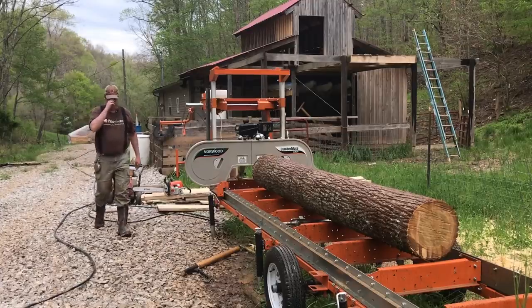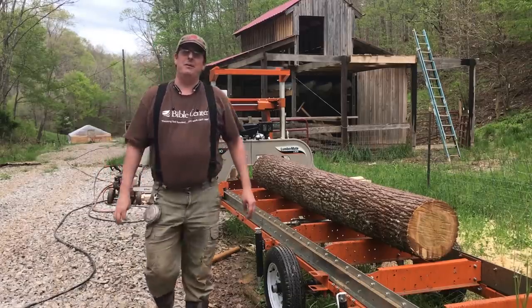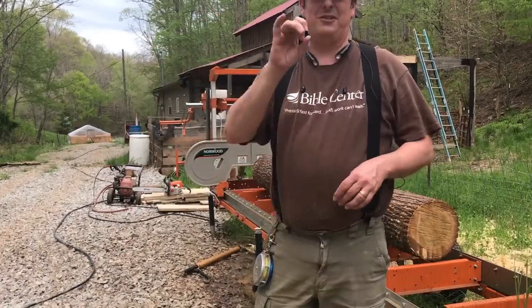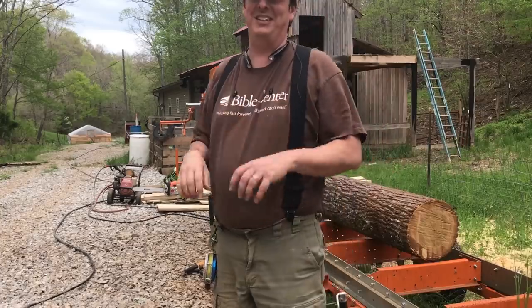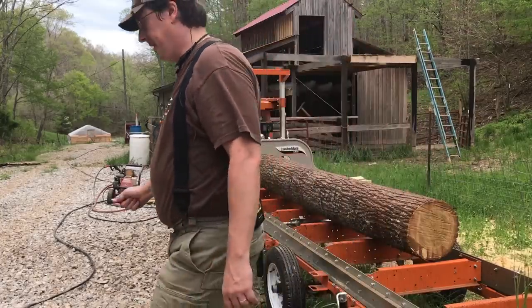You know what the problem was, why I wasn't getting pressure? There's mosquito larvae pulling from the tank. I've got this real fine screen on the pressure sprayer so it doesn't mess up the pump. Some mosquito larvae are all getting wedged against that screen, so it's restricting the water flow. Clean the screen, you get pressure. Cut that.